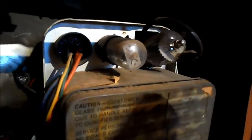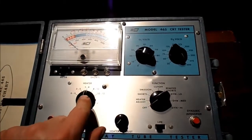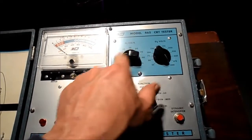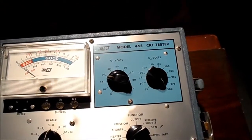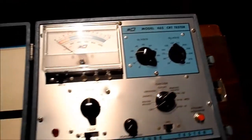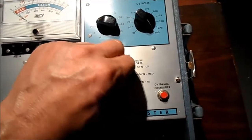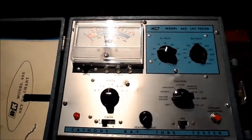These plate caps come loose but you can easily solder them back - you want them to stay tight. We're going to start with our heater down in the 5 to 8 volt range. I believe the G1 was 27 to 70, something in that area. Let's do our heater adjust - about 5 volts.